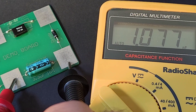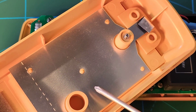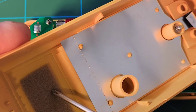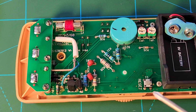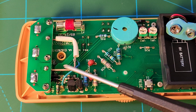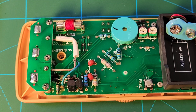Here's a 3.3 microfarad capacitor coming in just under 3 microfarads. Let's look underneath. Look at that beautiful shielding on the interior of the RadioShack multimeter — boy, they sure knew how to do it back then. There's a little bit of foam for the 9-volt battery so it doesn't toss around, and there is the main PCB — absolutely gorgeous. Big current shunt; this did not have a fuse on the high current, strictly that current shunt. Look at the soldering on those input jacks. Wow.